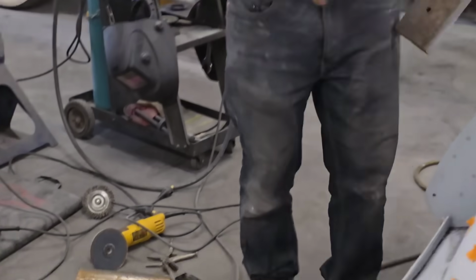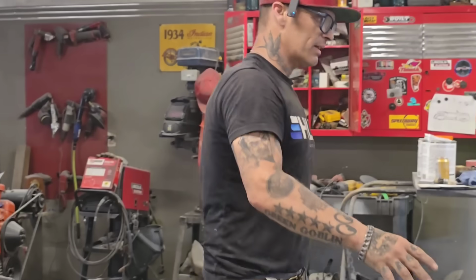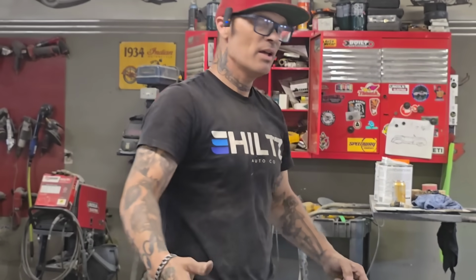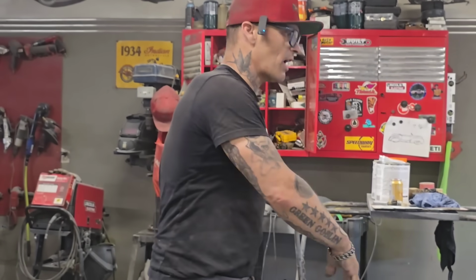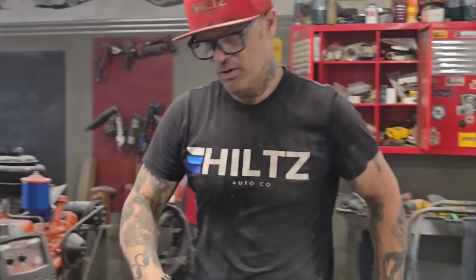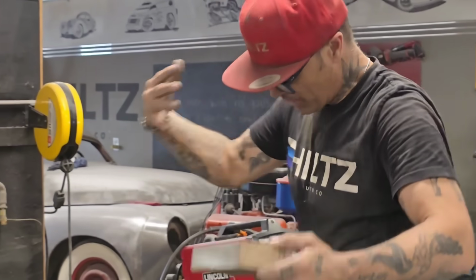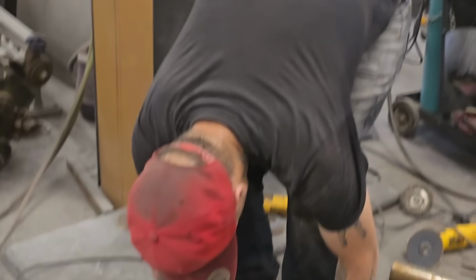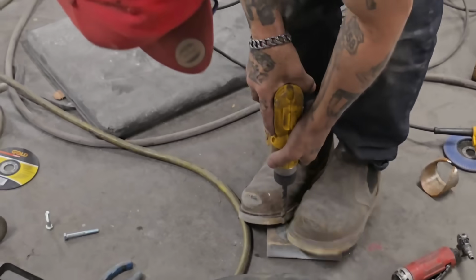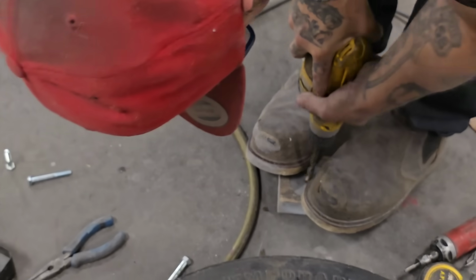You'd be surprised how much product gets sanded off the car as you put product on. You think, man, I'm using lots of product. There's so much product that comes off the car after doing what you're doing there. Like when you're hitting body filler, when you're priming, you're basically taking all the primer off because you're back to that body filler again. Some people realize it and some people don't. Where it needs it is where we want it. Where it doesn't need it, we don't want it.